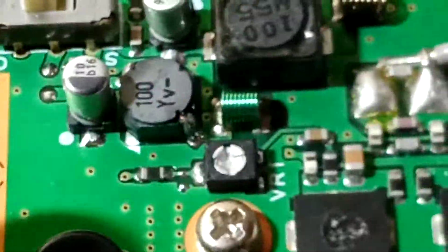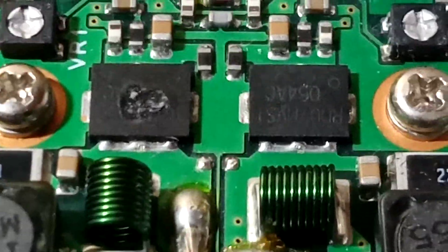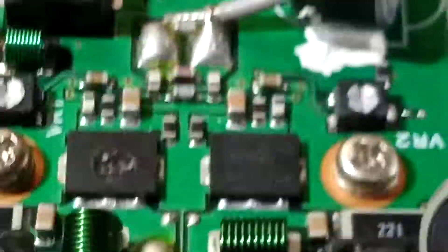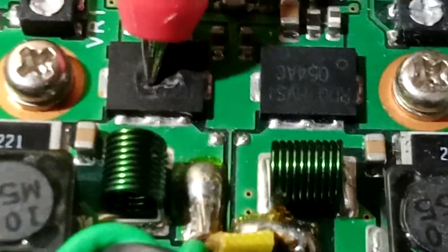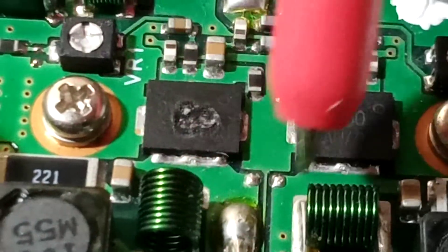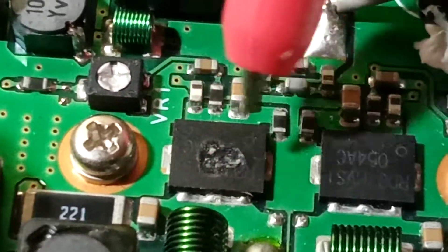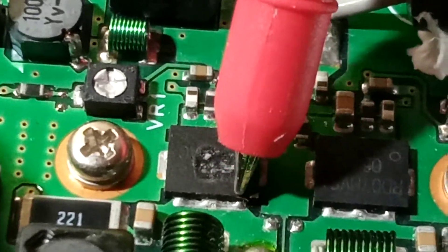But I will clean all that off. So what I've done for the time being so I can use it as a receiver — I've unplugged the jumper. I've unplugged the jumper there. That bit removes the voltage to these two MOSFETs, so therefore I can operate the radio as a receiver. I'm not causing any more damage to the radio or any more scorch marks. My fear was if I left it on in receive mode with this component getting hot, it could damage the PCB pads around it. And you look there, it looks like it's three pins, but now it's like it's one single pin each side — but it does make it look like it's three.